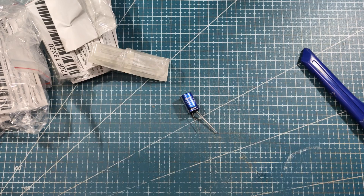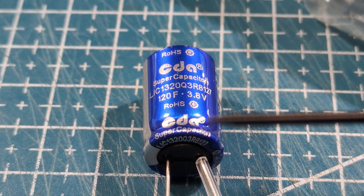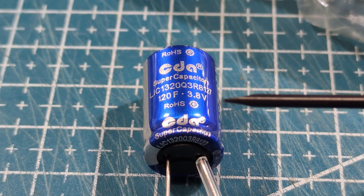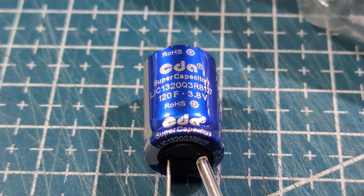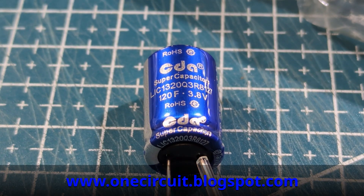Let me get in real close and look at the specs. Here's the little guy close up — different chemistry involved. It's pretty small, a couple of centimeters by a centimeter or so, but 120 farad, 3.8 volts. I believe I have a way of charging this up with just a little 2-volt solar panel using a charge pump circuit. Watch out for that video real soon — it's so close to coming together, and when it does, that will be a significant leap in the candle project. Good mechanical strength, no messy liquid chemistry, good charge cycles massively increased. I love these little guys.